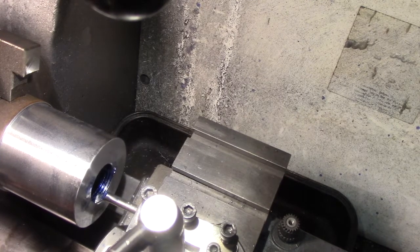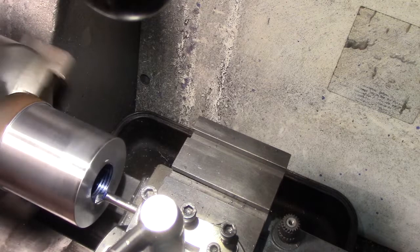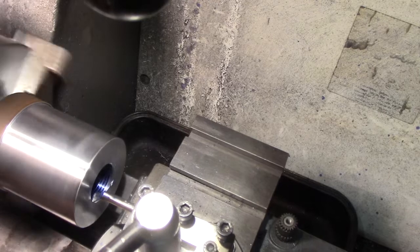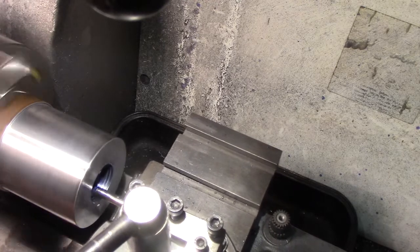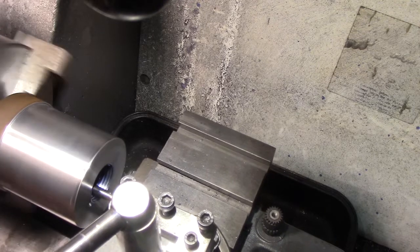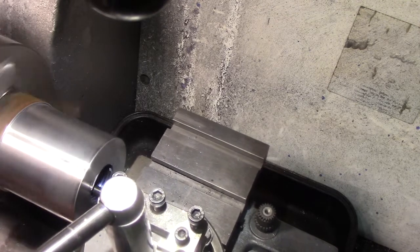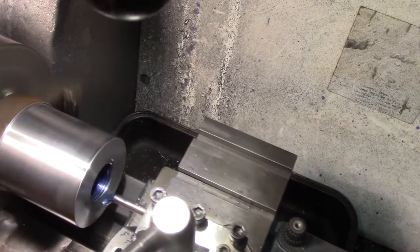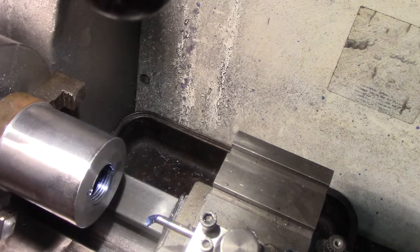This really is an odd bit of steel. The HSS bit I've got is having trouble cutting this but I'll persevere with very small cuts and see how it goes. I've re-blued it just to see if I can see what's going on in there. It's doing it but it's struggling.